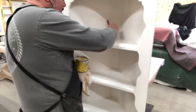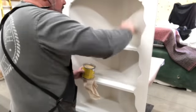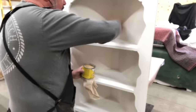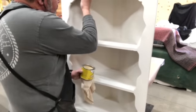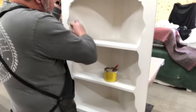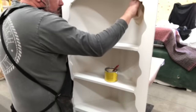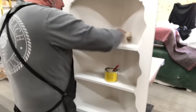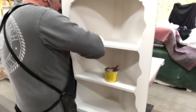The last layer of protection is finishing the entire piece off with Varathane Finishing Wax in the clear. He uses a waxing brush to brush it on, and then as soon as he brushes it on, he just wipes it off. It absorbs right in and leaves a nice smooth finish, sealing and protecting that white paint. And I have to tell you, the smell is wonderful.